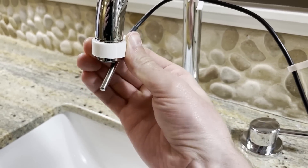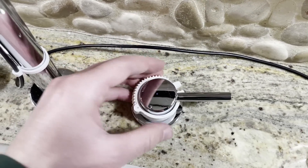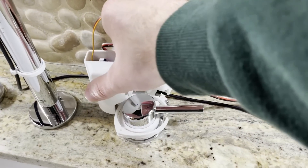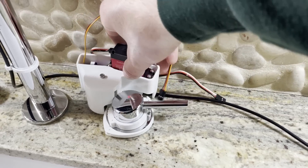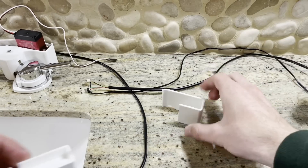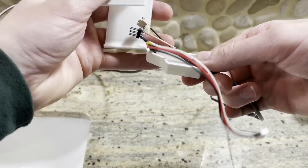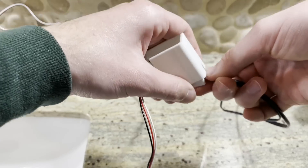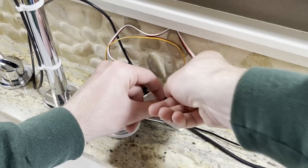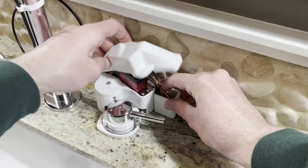With almost everything put together, the rest of the setup has to happen next to the faucet. The thermometer gets attached, and the gear gets clamped onto the tap. Then the rest of the mechanical parts are clamped around the base of the handle. Another little case holds the junction where the motors and thermometer connect with the wires coming from the UNO. This just slides up against the mechanical housing, then all the wires get stuffed inside, and the top piece holds everything together.